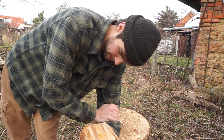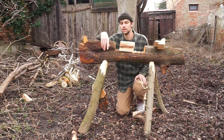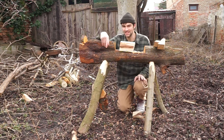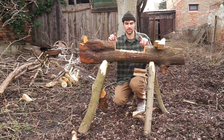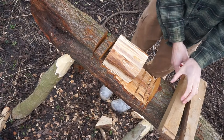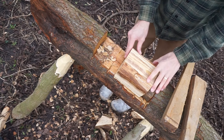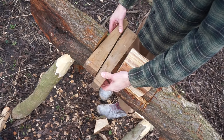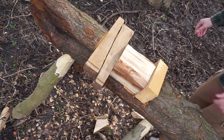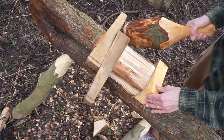So now we can clamp this and get hollowing. This thing has a few different names out there in the wood world — I know it to be a bowl mate, other people call it a cup horse, bowl donkey, or a vessel camel. It's a log cut-out that you use to place the piece of wood in between and wedge it in using two wedges. You can see how I'm beginning to wedge this in now — the piece of wood goes in the middle and I'm just going to add a spacer on this end, then tap the end ends just here to keep it nice and locked in place.